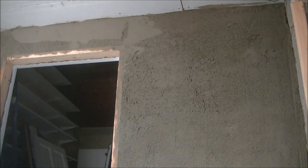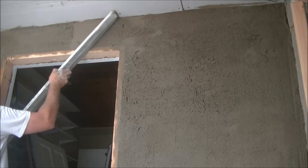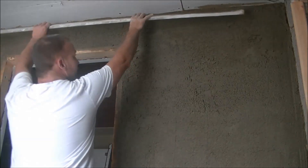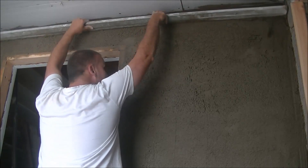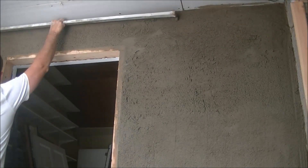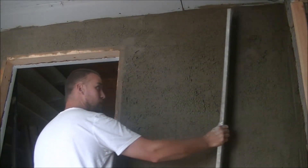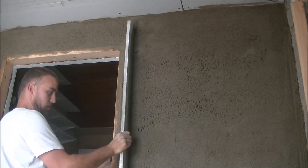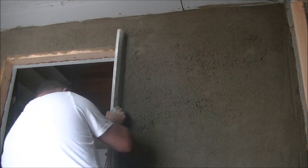I'm the opposite — I actually like to try to coat it almost spot on and I don't mind filling out my slacks. If you coat too heavy around the likes of a door frame, I would coat up around the frames and let it take up, then go about my business doing other walls, setting up rules, floating other walls, and let that take up. I find if you try to go too much in one coat, you can end up watching it slide off onto the floor. Sometimes it's better to build up gradually and not try to get too much on at once.